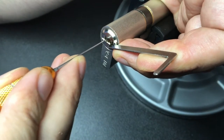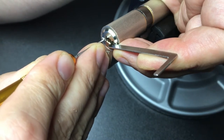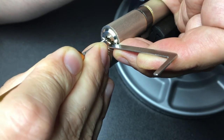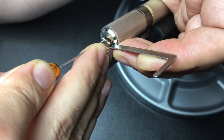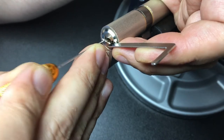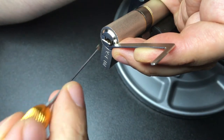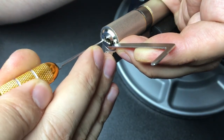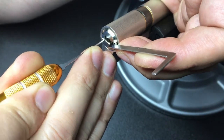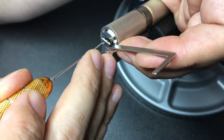I'm going to be picking along this warding ledge. Going down — nothing on one, nothing on two, nothing on three, four, five's binding a little bit — just going to wiggle the pick past it — click. Same for six. Back to one, little click, two, three — and look at that, we're in. A very default set, so I think the spool pins here are going to be quite skinny. One, two — a little bit of counter-rotation on two — and we got it.